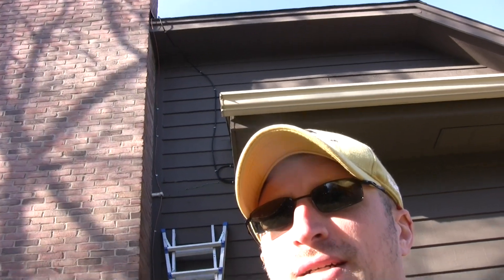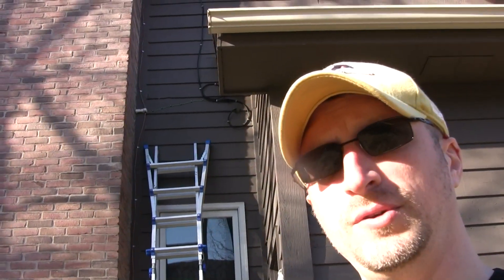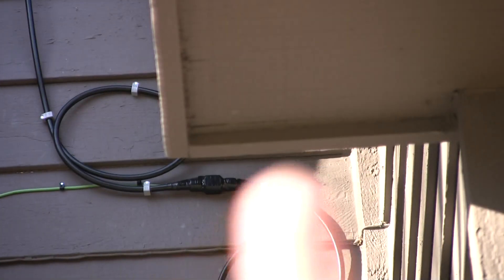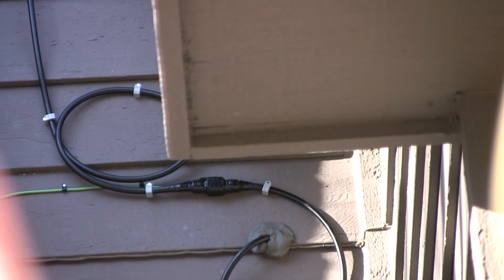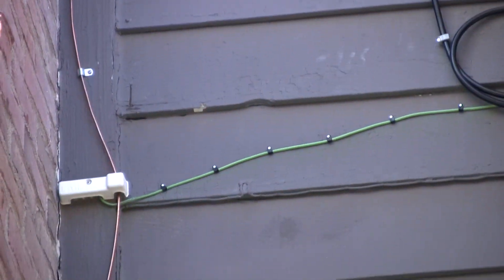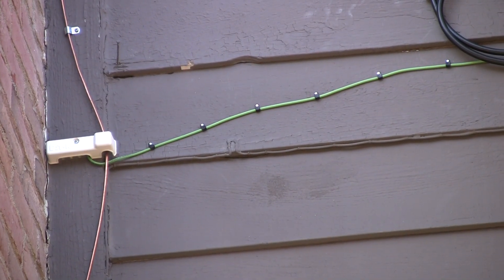You can see I've done tie-downs or staples all the way down here — about every foot and a half. For the little green wire that comes across, it's every few inches just to reinforce it. I was able to put everything in professional grade electrical tape, and then the service loops are going there. You can see the green wire going across to the ground block, coming up on the underside.